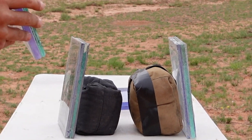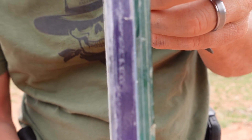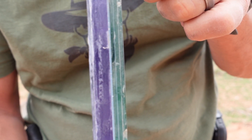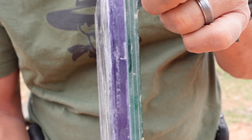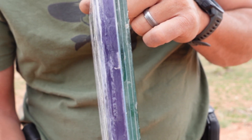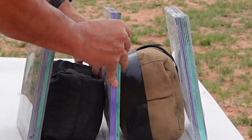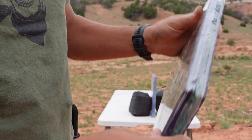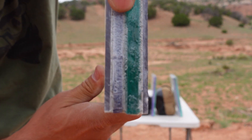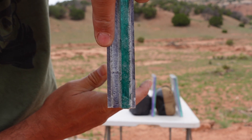The half-and-half plate: the soda lime glass is the strike face, with three-eighths inch polycarbonate and an eighth-inch polycarbonate behind that. Hopefully the polycarbonate doesn't plug out and the other one will catch it. For the front of the strike face we just have security film. The online plate has polycarbonate, three-eighths glass, three-eighths polycarbonate, and another polycarbonate in the back.